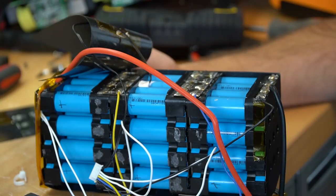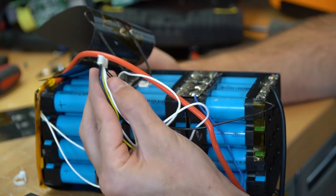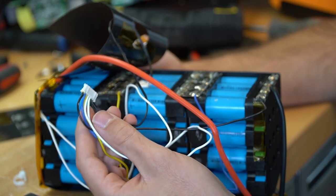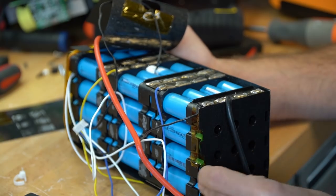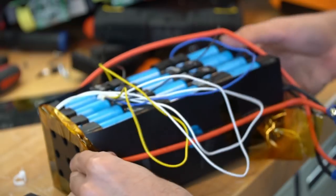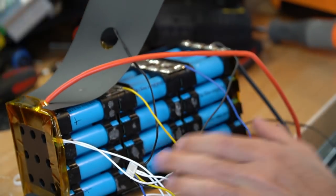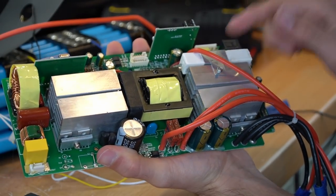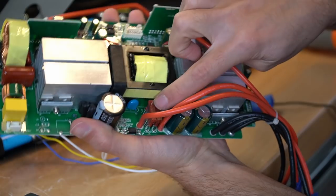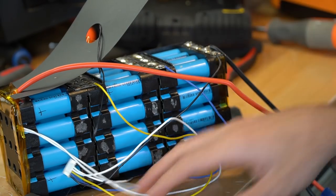Now the battery pack. We have three parallel packs in series, with balance cables going everywhere and a temperature sensor. These wire up to the inverter board and charge circuit board. These cells are not individually fused, so I'm guessing they have their own internal protection. Having globs of solder isn't that pretty, but it would work. Wait — there is no BMS. This has the balance cable and temperature sensors going to this board over here. All the BMS safety features are on the main board. These lines are not fused on the battery itself. These are the main fuses — you do not have a BMS with overcurrent protection on the battery. I don't like that. I like the BMS close to the battery. Also, these wires could short if it has lots of vibration — this is not a long-term battery design in my personal opinion.